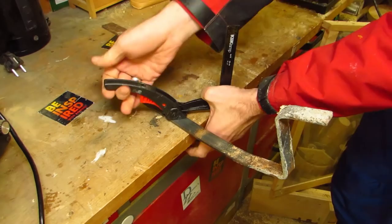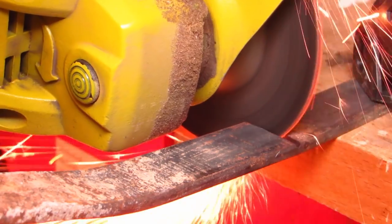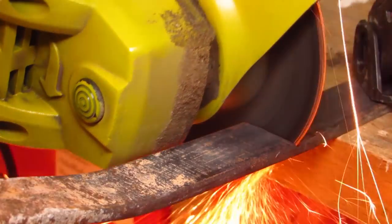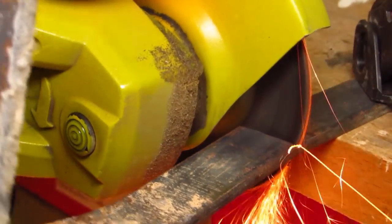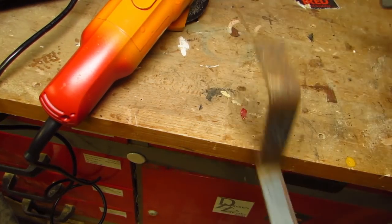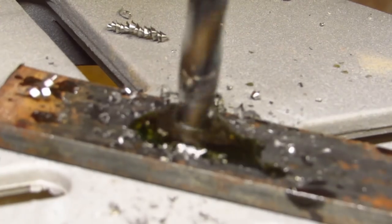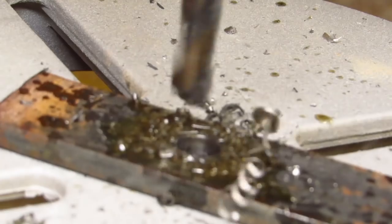This piece of thick stock served for about 30 years holding heating pipes in the foundation of the house. Now some weirdo comes along and clamps it to a workbench, then cuts off one end to get to a flat piece. Then I drill a hole into it with the diameter of the desired dowel — 8mm in this case.